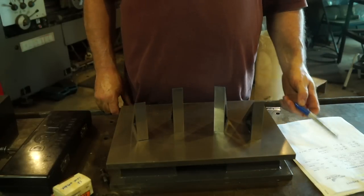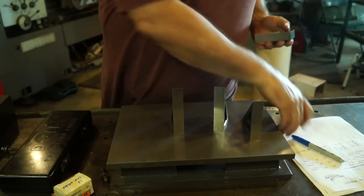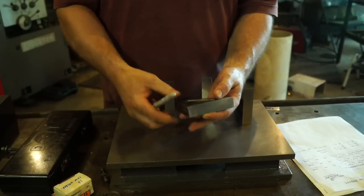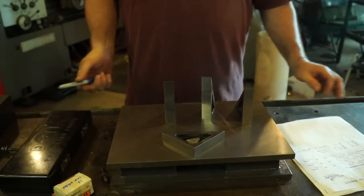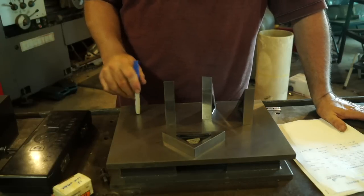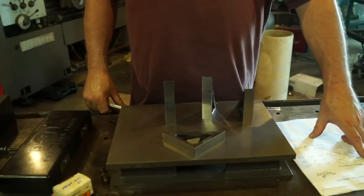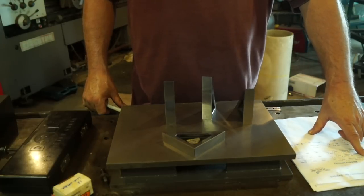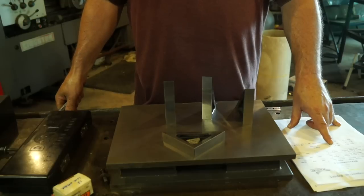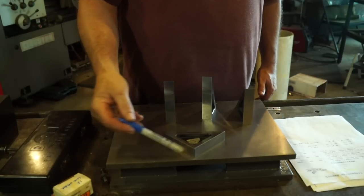The first angle is B3, which is this 45-degree angle here. The results from the test were done in decimal angles, so I've converted them to minutes and seconds and then to inches. B3, the first angle, turned out to be 44.986 degrees, which translates into 44 degrees 59 minutes and 10 seconds. That's telling me we're off by 50 seconds, which is like eight-tenths overall in five inches.